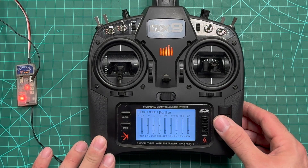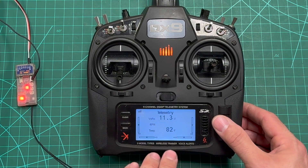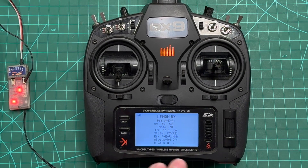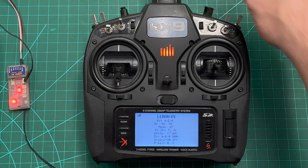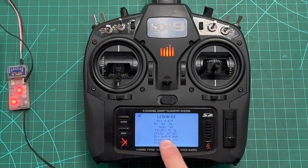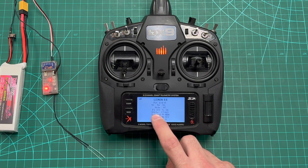Once you're bound, to get into the menu you'll see a lot of data: battery voltage, temperature, receiver voltage, and more popping up. These are the auto config telemetries and you can adjust them — add more or less depending on what you want. On the screen you're able to see your current settings for aileron, elevator, and rudder: whether they're normal or reverse for gyro direction. You can see the status of your always-on switch, your master gain, the stabilization switch channel (in this case AUX2 or channel 7), flight stabilization mode, and whether failsafe is on or off. Telemetry is turned on and the mode is currently normal tail.